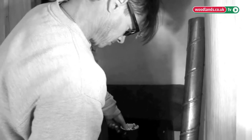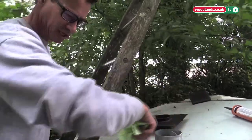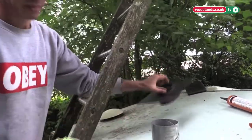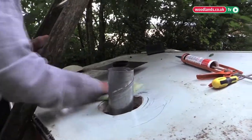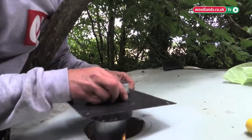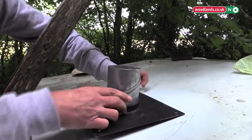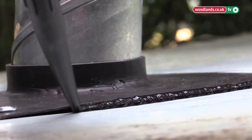This is fire cement — I'm just going to wedge some up into this gap here. I don't want any fumes coming out through here, just putting in an extra safety measure. We're going to put some silicone around here — some heatproof silicone. Stick the plate over; if it's dirty it won't stick properly so I'm just going to dry that off. There are some self-tapping screws. There's a little gap around here just to stop any rainwater going in there — this is our rain stopper.